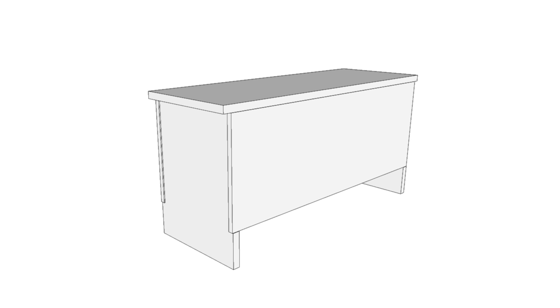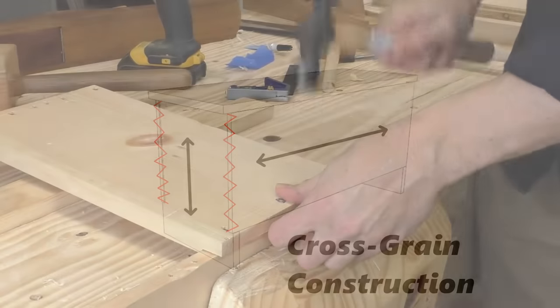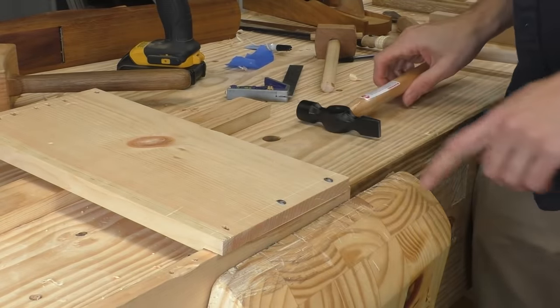Now we're ready for the joinery, and that's the most exciting part of this project, because there is no glue in this piece. The major joint is a simple rabbet, held together with rectangular cut nails. We use nails because the grain of the front and back goes one way and the grain of the ends goes the other way — this is called cross-grain construction, because these boards will expand and contract in opposite directions as the weather changes. We can't glue this construction because a rigid glue joint will just fail, so we need a connection that's both strong and flexible. Traditional cut nails wedge into the wood for a solid hold, but they also have the flexibility to move with the wood and stay together for centuries.